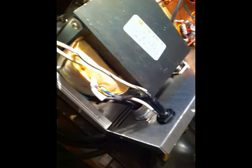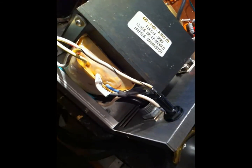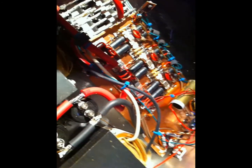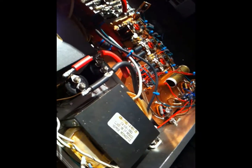And another thing — this is a 110-120V input. We do make our amplifiers to accept 230-240V as well. I wouldn't recommend it on an amp of this size, but anything 8-pill and up it's definitely an option. If you're going to be running 16, 24, or 32 pills, I would recommend a good 240V setup.